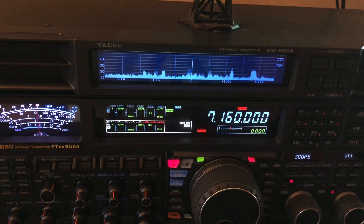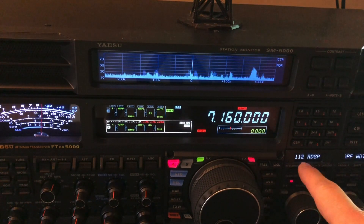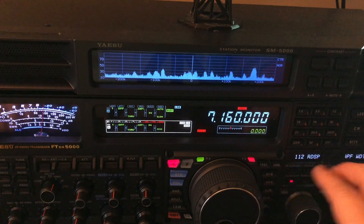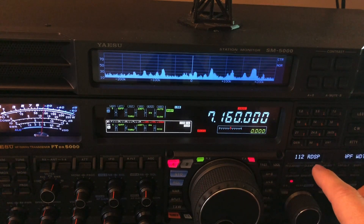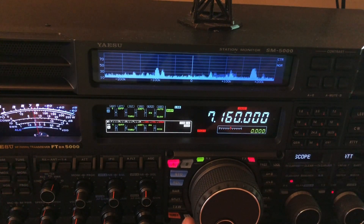Now while I'm on the scope, let me give you a bonus. I'm going to leave it at 10 dB and press the CS button to get back out of that setting. The CS button has a double purpose — I've covered it before. You tap it and it goes to your favorite menu choice; I've got mine set at 112. Long-press the CS button to assign your favorite menu choice, and next time just tap it to go there. But if you long-press the button it goes into the scope parameters.